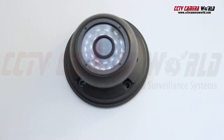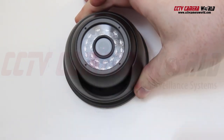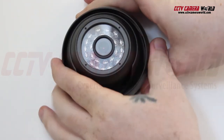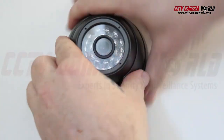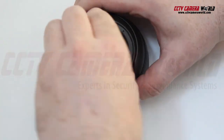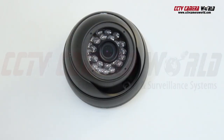While bench testing the camera, we noted at what position the image would be upright and placed the camera appropriately. When you're finished with that, attach the sleeve and collar. Use the divot on the sleeve to make sure that you don't have IR bouncing back at the camera, as this could cause issues at night. Once you have the camera properly aimed, make sure that the collar is tight and the job is complete.